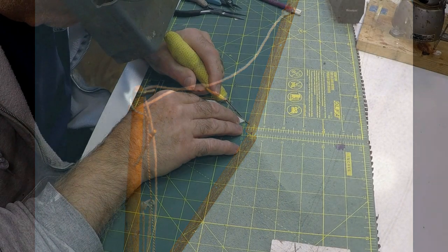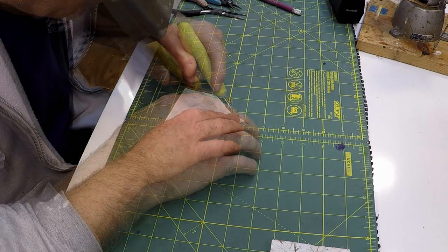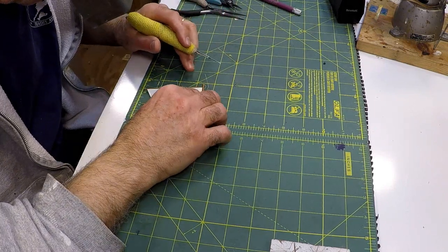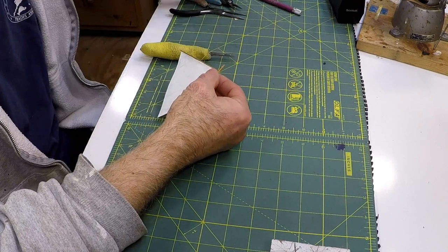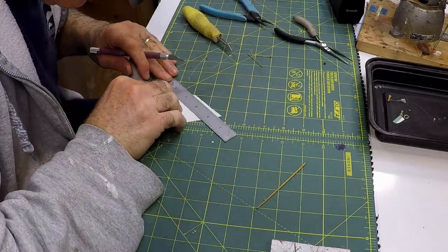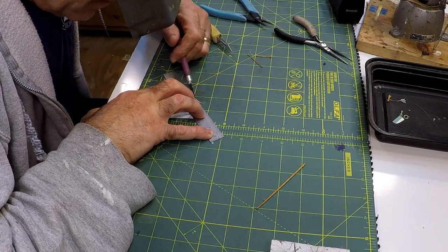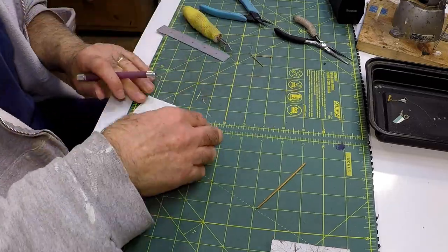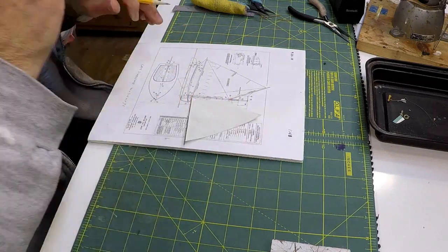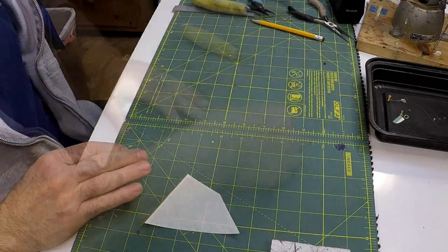It was necessary to just about completely disassemble the rig. The only two pieces that were left together were the boom and the sail — everything else came off. The gaff was broken, so that had to be cut away carefully. I had to make sure I had a nice straight edge on the sail, so that I would have a good gluing surface when I make the new gaff and reinstall the sail on the gaff. I marked out the location of the five mast hoops on the sail, and then I made five small puncture marks through the tabling.